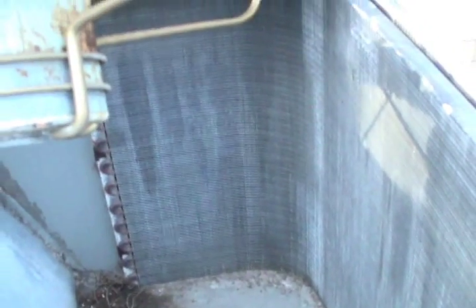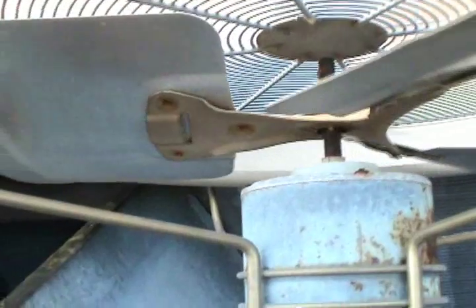The hot gas travels through this hot gas line, which will travel through the condensing coil. Here's the condensing coil right here, where both latent and sensible heat will be given up, with the aid of course of a condensing fan.